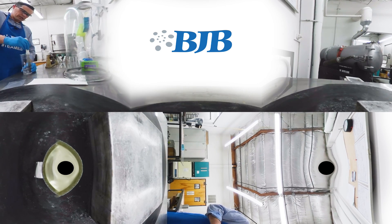What we're going to be doing today is showing the vacuum degassing process. Now, with all of the BJB materials that we have, the water clears are the least forgiving of visually seeing air bubbles trapped after mixing.